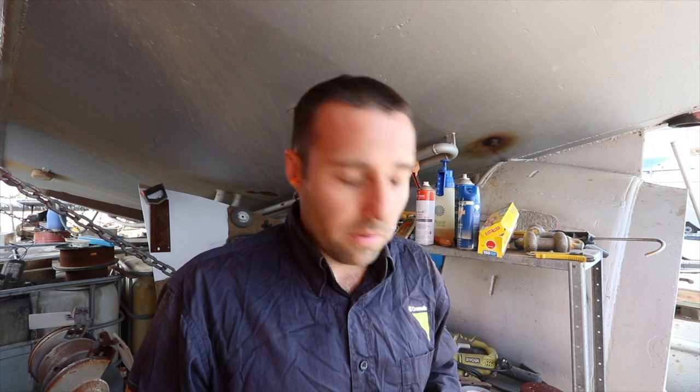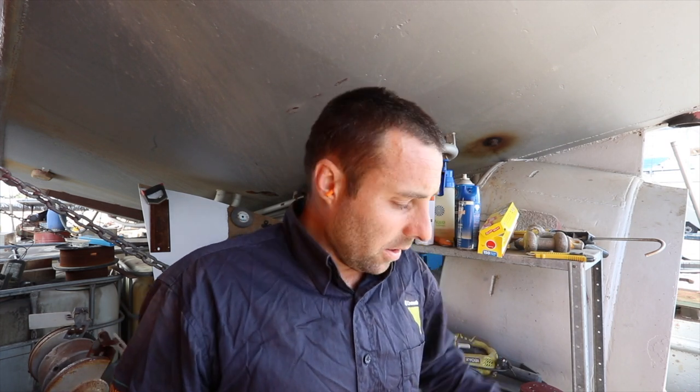And then whatever's going on at the gun end, if there's any resistance at that end, it just basically doesn't feed through. So as soon as I straighten it out and keep it absolutely perfectly straight, we don't seem to have any drama getting a decent weld. So that's my solution for now: keep that welder as straight as possible, and then make sure we've notched out all of our welds, all of our joins, so that we can get a good weld bead right down into that steel.